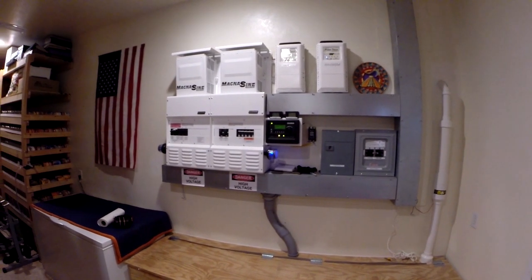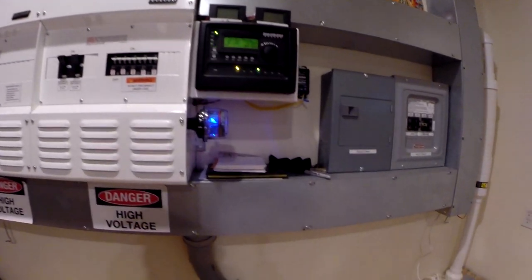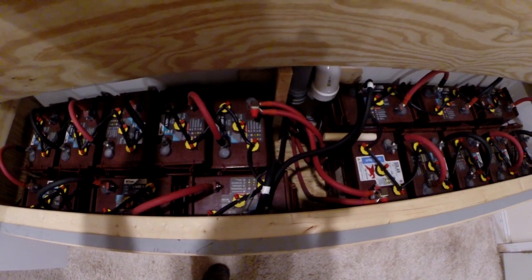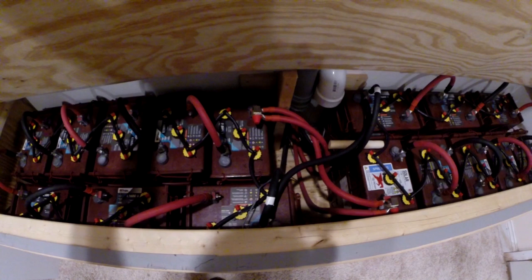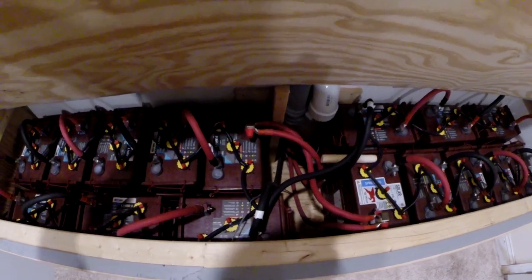And the way I'm doing that is with this off-grid, battery-backed solar power system. Now this thing has two 60 amp chargers that can dump up to 7,000 watts into this battery bank continuously for 2 hours, or however long I want till they're charged. So basically I'm just going to set it up for 6,000 to 7,000 watts and let it run continuous for 2 hours, and I don't have to mess with the RPMs.